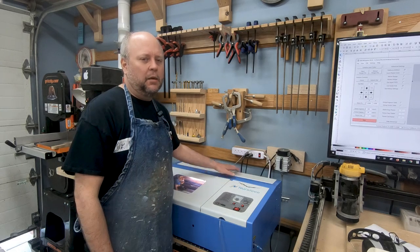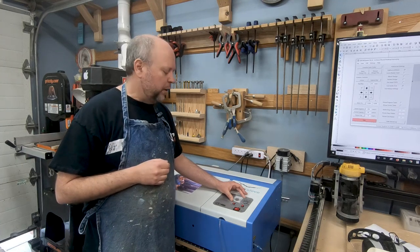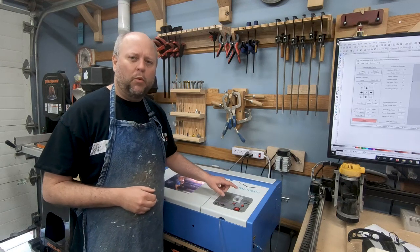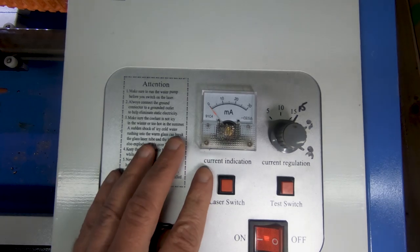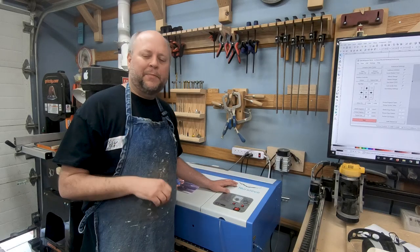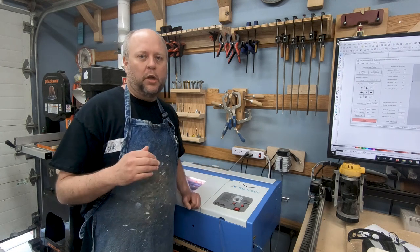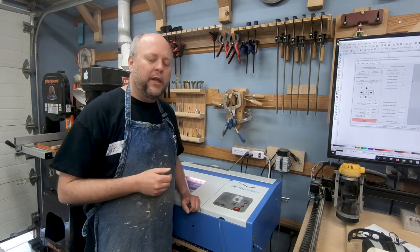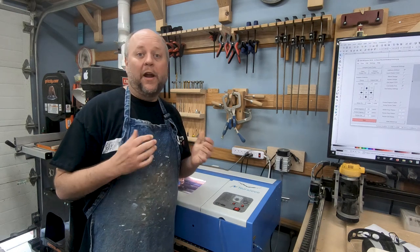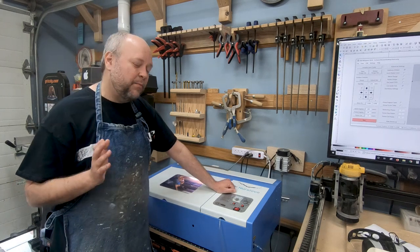You'll come across a red machine and a blue machine. The important thing is the meter. The red ones typically have a digital readout which sounds enticing, but unfortunately it's not very useful because it's measuring percentage of power. What you're looking for is something with an analog reader — not nearly as sexy but it gives much better information, measured in milliamps, which tells you how much power is going to the laser. In online communities when troubleshooting, people want to know milliamps, because 10% or 20% doesn't mean anything — there are no concrete numbers to reference. So if you're in the market for a new one, look for the blue ones with the analog readout.